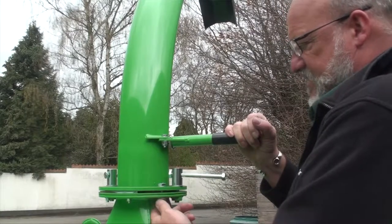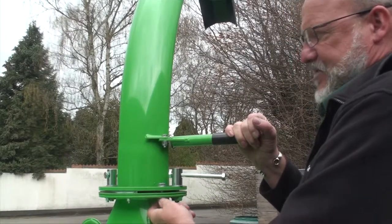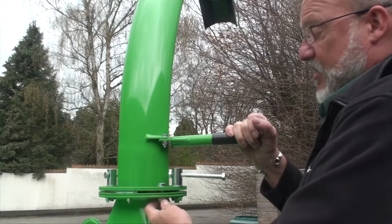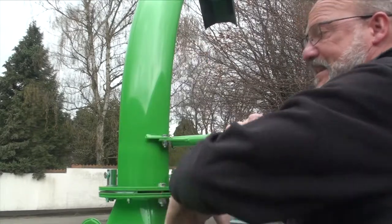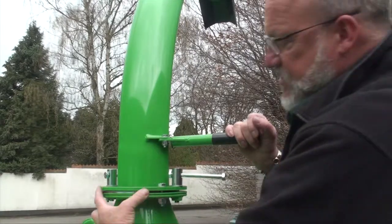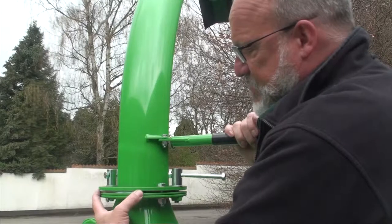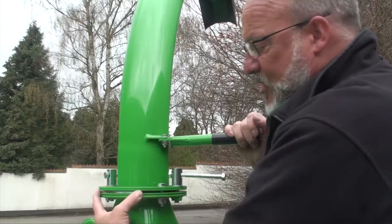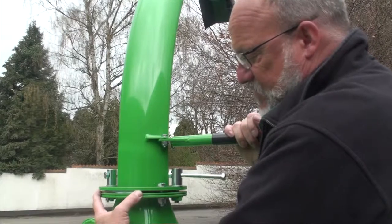This loose bolt here is in place as a safety device, so you have to use a thought process and extra tools to lift off the discharge chute — that way you can't put your hand down inside it while the machine's running without a clear thought process. A fillet of steel there means all discharge chutes cannot be turned around 360 degrees, preventing it being turned over the top of the operators — a common feature on all wood chippers.